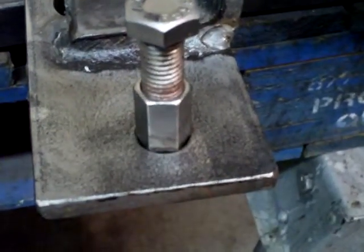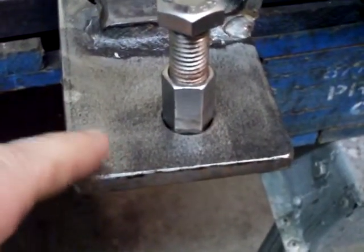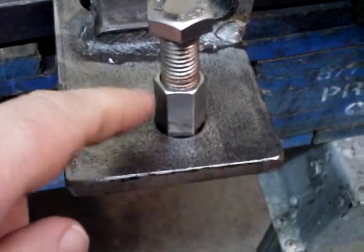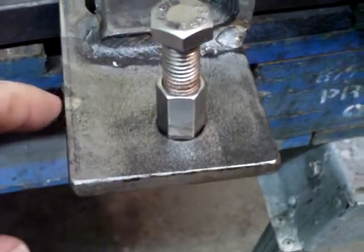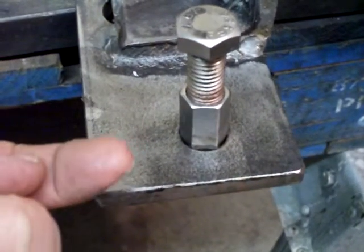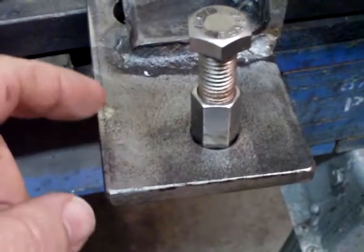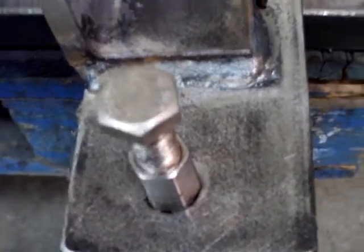It's the only way to do it. This surface of the part is coated with a wax, so when I weld this, any little spatters are going to hit this wax — you can see it on my finger there. It'll burn into the part a little bit but it won't stay; I can rub it off or sand it off real easy. That's on both of them.